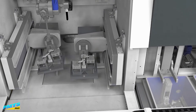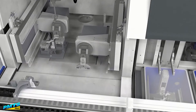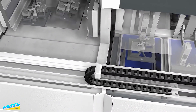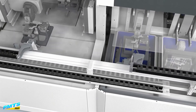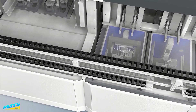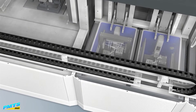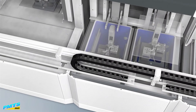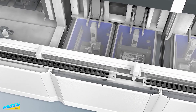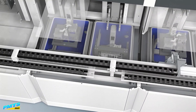What you see here is we're processing a part on a pallet. We've got a tool changer, we're going through the deburring process, and now we do a handover. We move from deburring over to our cleaning process. Out front there's an integrated transfer that is moving this pallet between each module. That allows a high-speed integrated way to move from module A to module B to module C. Inside each one of these chambers we can have targeted cleaning, general cleaning, and pre-drying — it works like an old transfer machine but in a new, very flexible way where you can configure exactly what you need.